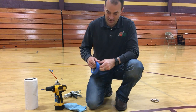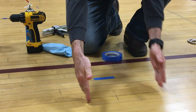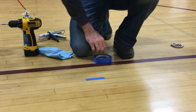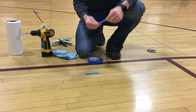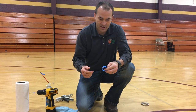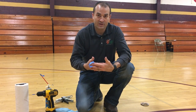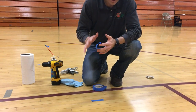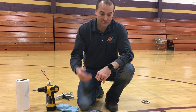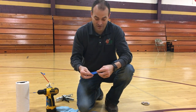I'm going to take our blue painter's tape and mark a couple of spots — let's say this is our dead spot area. If it were a sleeper system, I'd have rows of magnets in a pattern and I'd want to go right between those sleepers. In this particular case, this gym floor is two layers of OSB installed about 27 years ago, and it's noted to probably be a first-to-second layer separation — where the OSB layers themselves aren't separated, but there's a separation between the lower layer and the top layer. You can tell when you're pushing or deflecting the floor, it almost has a clapping effect. Therein lies the installation consideration: the first layer has to be nailed to the second layer appropriately with enough nails to bind both together.